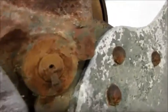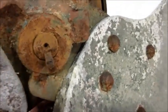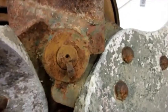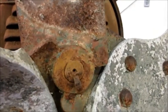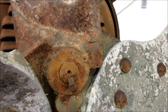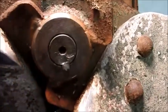The first order of business is going to be to get the blade off, and from the looks of that, it is rusted and that key is still there with the head on it. But I remember from my 48-inch build that the head just shears right off, so I'm sure this is going to require the puller bolt holes to be drilled. And rather than wasting time, I'm going to go ahead and get on that and try to get this pulled off. As expected, that sheared right off — didn't move the key out — so this is going to be puller time.